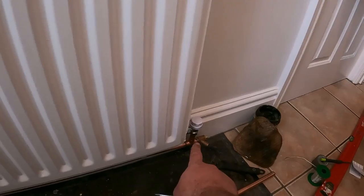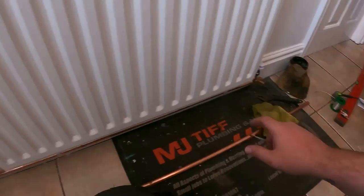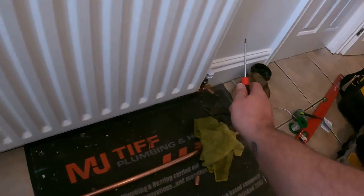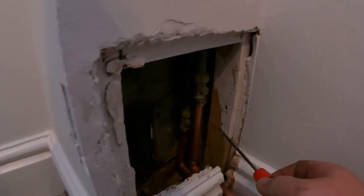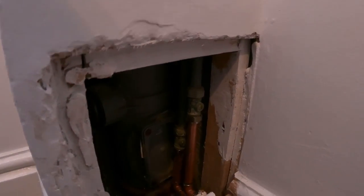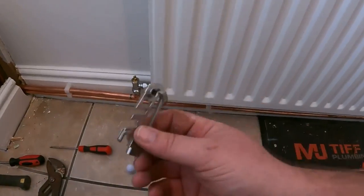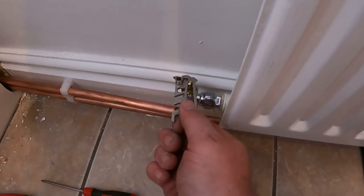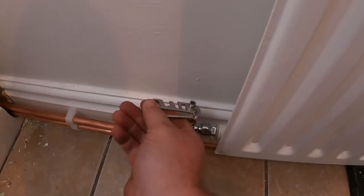That's the rad done — piped it up at the end, put a drain off on the end just in case you ever need to drain anything down. Quite handy having it here in the utility. Connected up in there. I've got the cap off. So let's turn the heating on. Hopefully these isos don't pass in the middle because that would be an absolute pain. They're good — that's on. We've got water up to the valves. Let's open up the Plum Chum — I'll go over that in a second. Let's open up and get some water into the rad.